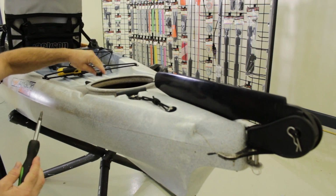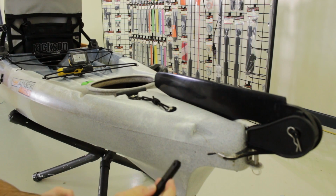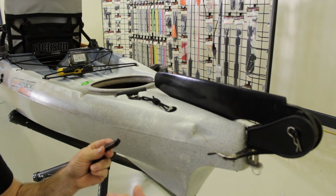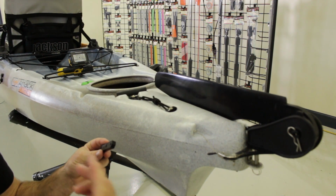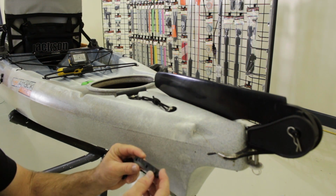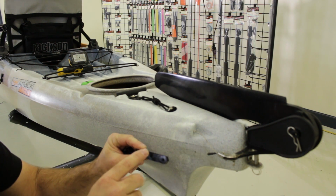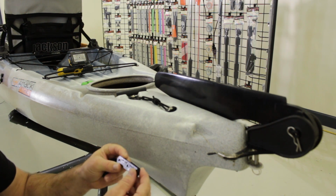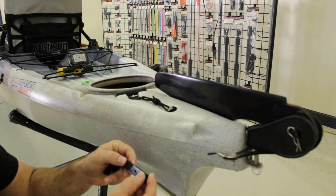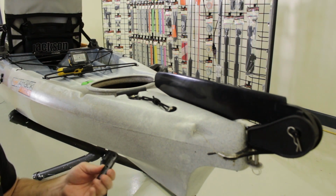One thing I do want to mention is if we take a look at this backing plate, there are 3 holes. The reason for that is because if we did need to use a rigging bullet technique, and if you're not sure what that is, do a YouTube search for it, we would need to have 3 holes because you need 2 of them for the rigging bullet and you need 1 to get a screw started in. But even though we've got 3 holes here, because we're able to reach this, we're not going to drill all 3. There's no need to.